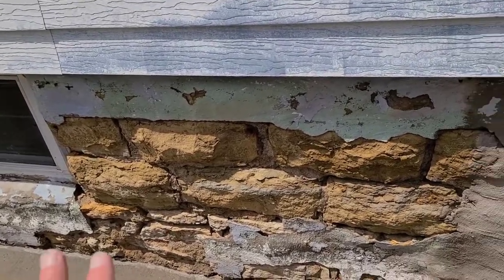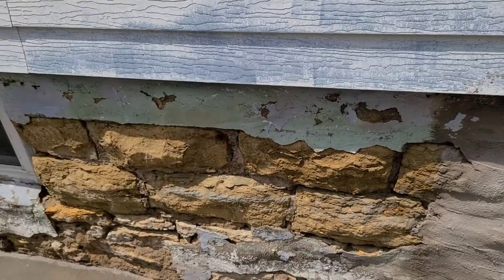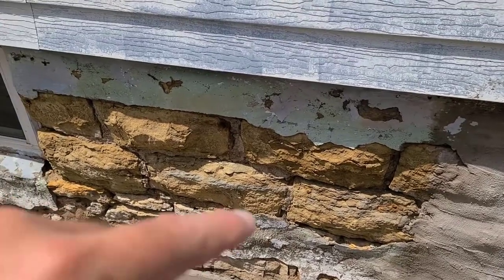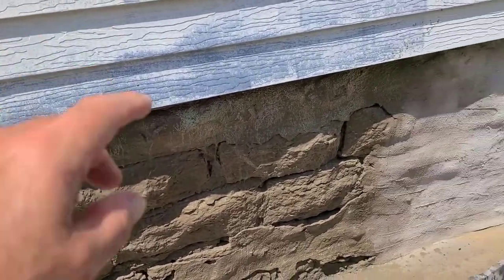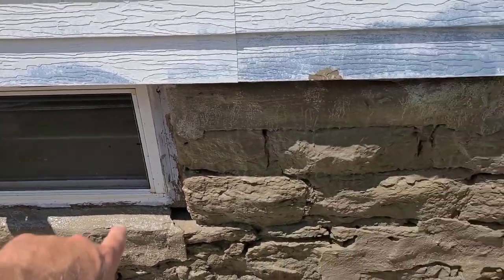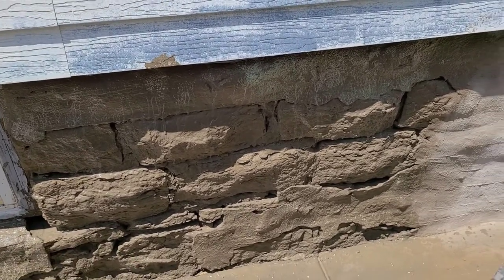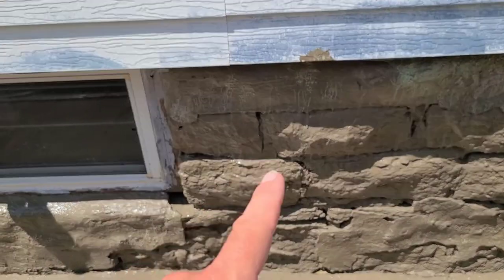It would be better if this was a two-man job, because one person would be mixing mortar and keeping everything wet while the other person does all the finish work. But I've done everything else by myself, so I'll manage. Okay - I just got done painting on some portland on this part here, went down to about right here. I had some extra so I went a bit further than I wanted. I'll put the hose on mist and keep it damp in between filling in these cracks.